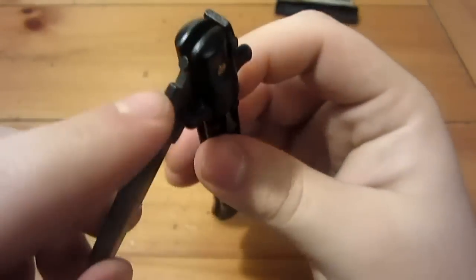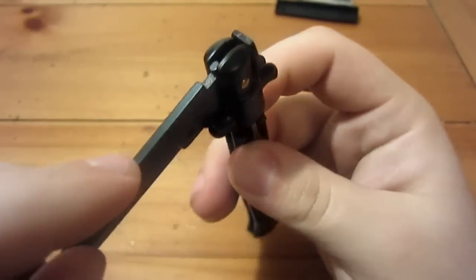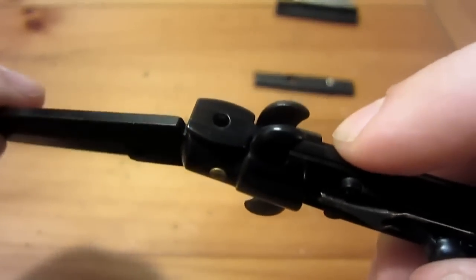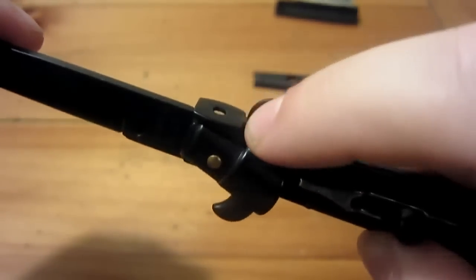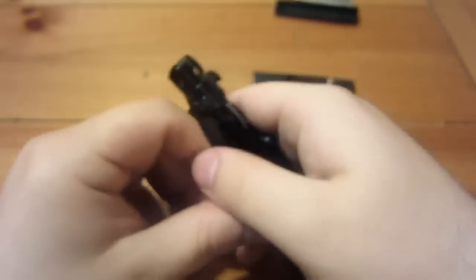You can see how this locks into place: there is a pin on the spine of the blade, or the tang, and there's just a hole on this plate. Very simply, the pin goes inside of the hole — it's a very simple design. And again, to unlock that, we're pushing up on that bar by swiveling the bolster, and it frees the blade. That's how the lock works.